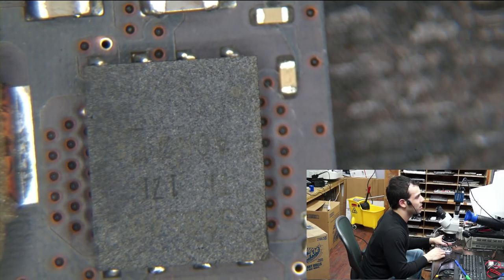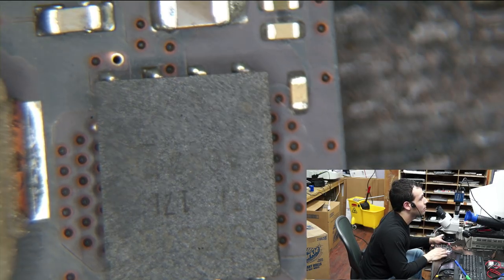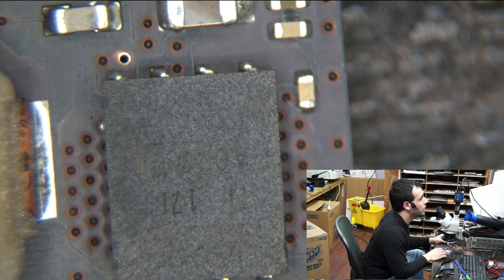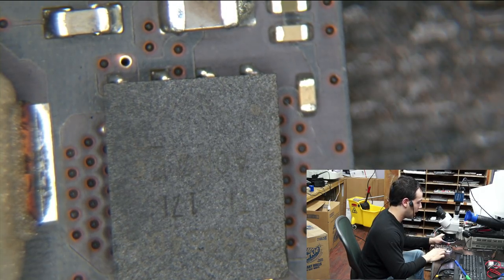One of the things I've always admitted on this channel is everything I do is kind of lopsided because I don't have much in terms of steady hands for putting anything or placing anything. But it soldered there well, and I always say that I clean these. A lot of people say, no, you don't. You leave the mess on there. But really, I actually do clean these. After I'm done with it, it gets put in the ultrasonic cleaner. It stays in there for a little bit. I toothbrush the junk off, and then it stays in there a little more. Gets put in the alcohol bath. Gets put in the oven, because again, you don't want to send boards back to people with flux all over them.